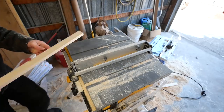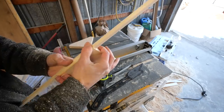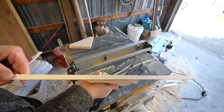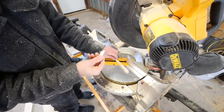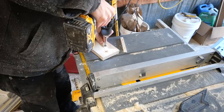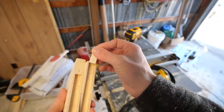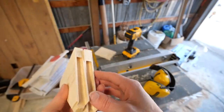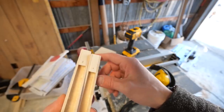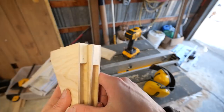Now I'm going to try to rip some half inch pieces of wood. These little chunks of wood fit right in here — we're basically creating a french cleat in the back of the shelf. I'm going to go inside and glue these in with wood glue and then tack them in with some nails. If you needed really strong shelves you could screw it, but the glue is going to be very hard, so I'll just glue it and nail it and come back when that's ready.